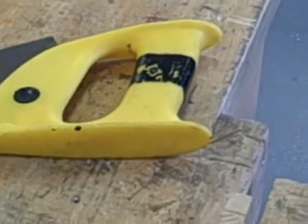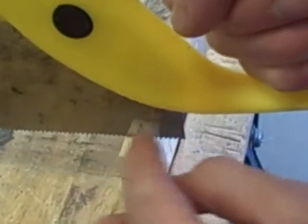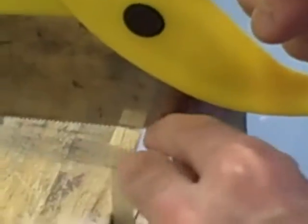Okay. You do that before you start cutting. It creates a little tiny nook, and that nook is going to hold the saw in place. If I didn't do that, the saw would be sliding around and it would ruin your work. Now you've got that, you can start using more of the saw, go from the back to the tip, and you're watching the line.